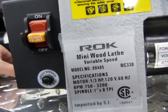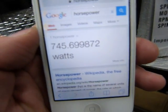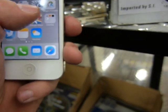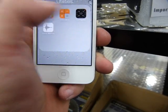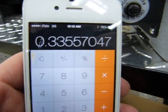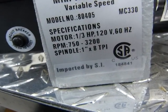Now how does 250 watts become a third of a horsepower? One horsepower electrical is 745 watts. So you take 250 divided by 745, which equals 0.333. Converting 0.333 from a decimal to a fraction, that's about one third. So that's one-third horsepower — there's your math.